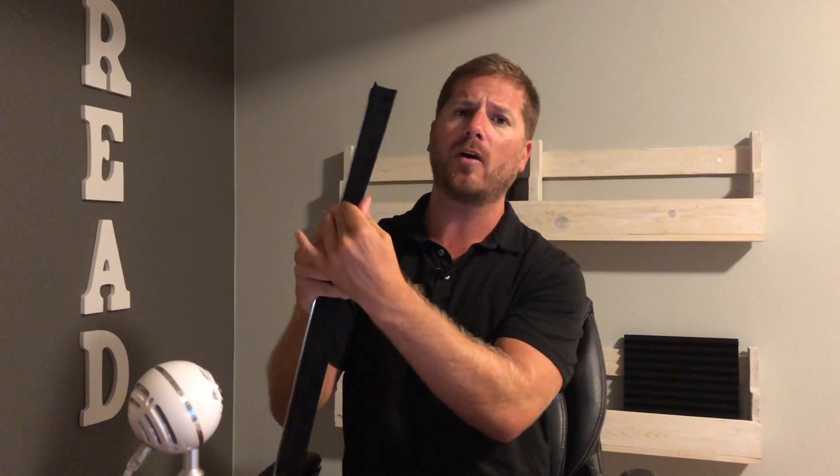Now for doors — if you're only soundproofing one or two rooms, simply install a solid core door instead of a hollow core door. The difference is that a solid core door is completely solid wood throughout, providing much more soundproofing than the typical interior doors found in most houses. Once the solid core door is installed, finish it off by adding a door sweep with a rubber bottom — these work much better than brush-style door sweeps, which are more suited for keeping out bugs than blocking sound.